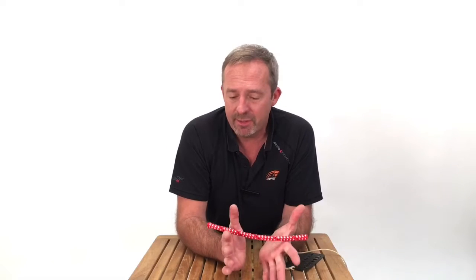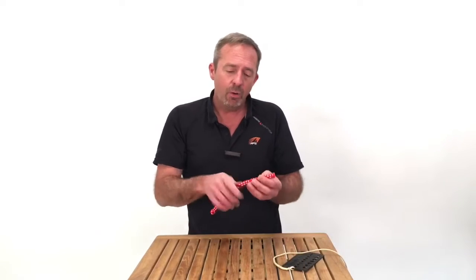And it goes on. So manufacturers are balancing a lot of things. When they set out to make a line, they may be trying to achieve a number of different things. Maybe the priority is a specific strength or a low stretch characteristic, or maybe a handling property. And maybe lastly, that's where diameter is in the priority line. So it's a tall order. So remember that braided line diameters vary, and a value that best represents the actual diameter is applied. So this can involve rounding a diameter up or down.